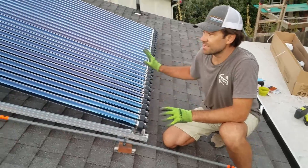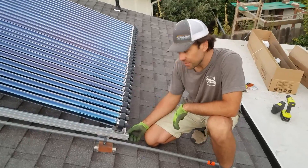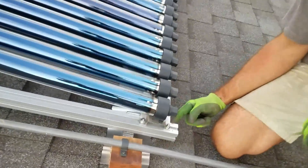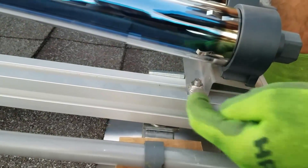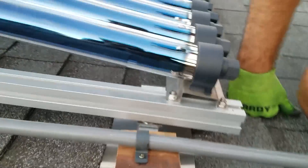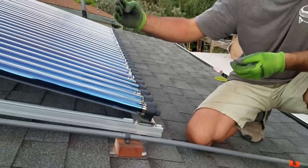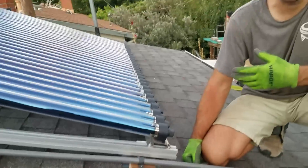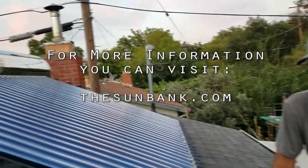We've got the tubes installed and everything is working and ready to go — we'll be producing solar heat tomorrow. One thing I forgot to mention is that we leave a little bit of play in these pieces, a little bit of room. The bottom bracket should be up about an inch from the bottom of the bracket — it could go about an inch and a half. When you're putting in your L-feet, note that this L-foot right here is blocking the bottom bracket from going up any further, so just be cognizant of that. If you have this at the bottom, you could move the tank down from the top to achieve the same result, but we do leave a little extra in this piece so you have some room depending on your roof situation. Sun Bank is installed — looking forward to having some solar heat, and thanks for watching!